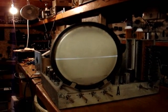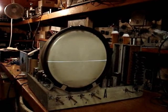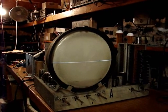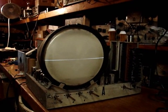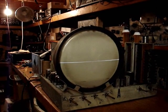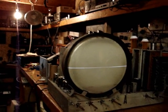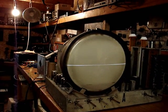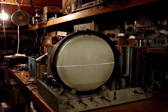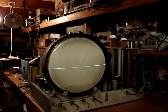The good news is I can probably live with that picture tube the way it is. I can maybe fix up the base on it so it doesn't feel so loose — it's an original tube, it says Silvertone on the base. Then I can upend the chassis and see what's actually going on and why I'm not getting vertical deflection, see what's been done, what needs to be done, and go from there.